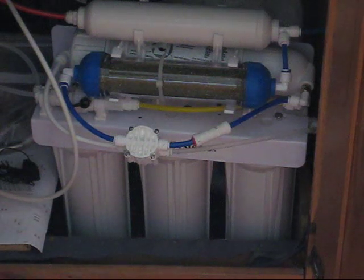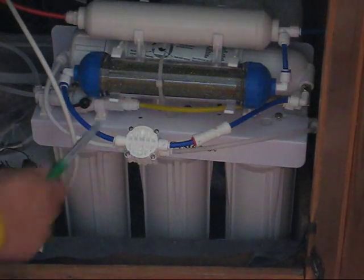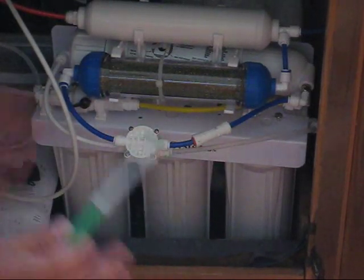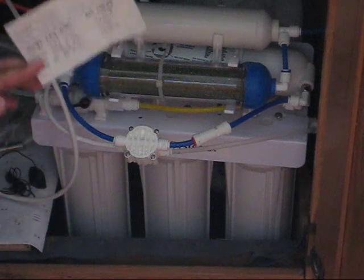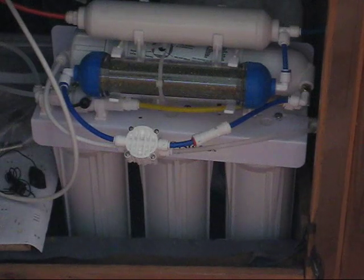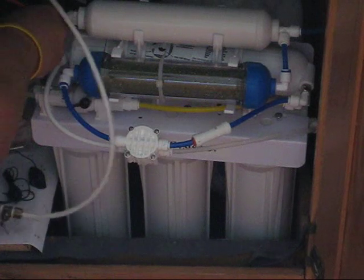Three things I want to mention as a little advice or tips. Number 1 is mark your connections before you disassemble the system. Then you know what's connected to what when you reassemble it. Number 2 is write down everything you did. Write a note and write down what you changed. It's always a good practice. That's your maintenance record. I'll keep this in a little bag here.